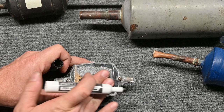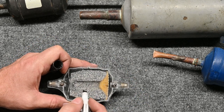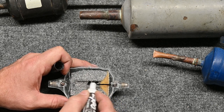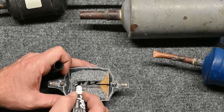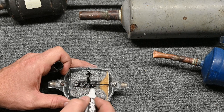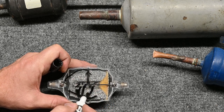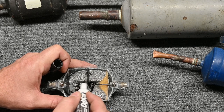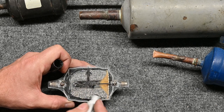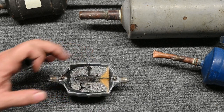That's an important concept. If we have refrigerant flowing in the other direction, we end up with the opposite effect — all of that refrigerant trying to be filtered through this very small amount of surface area. Then it goes through the filter or desiccant material and collects on the outside. So it would stop up a whole lot faster if we put this in backwards. Plus, we have the issue of desiccant material chipping away and ending up floating through our system. That's why we want it to be in the correct direction.